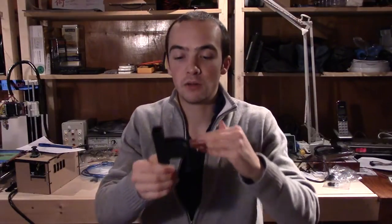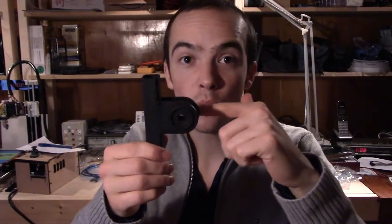It's the strongest point. But the problem with that is the way I broke it is by torquing it when I was trying to fold it open. And now the grain is like this. And if it's like this, there's a weak point going right through the center. So this thing, when I print it, will definitely be prone to torquing and breaking almost the same way as before. But I thought it was the optimal way of printing this piece, okay?